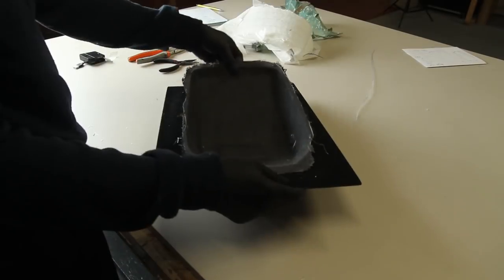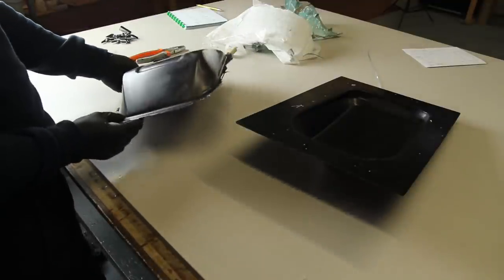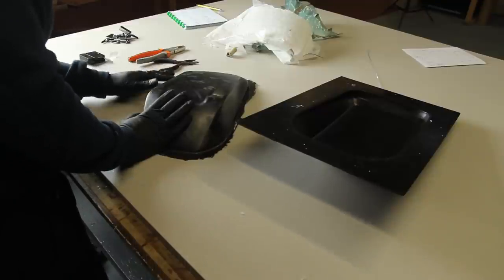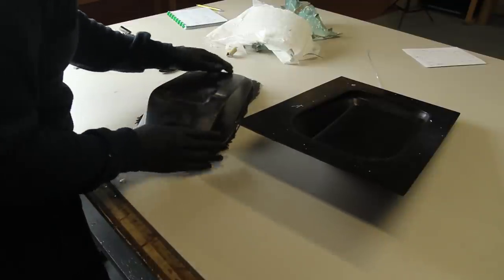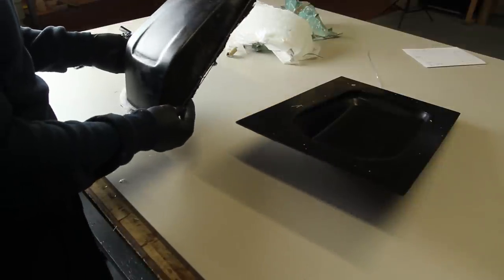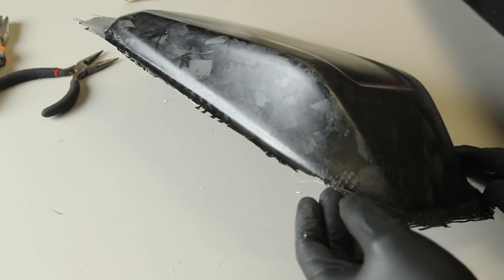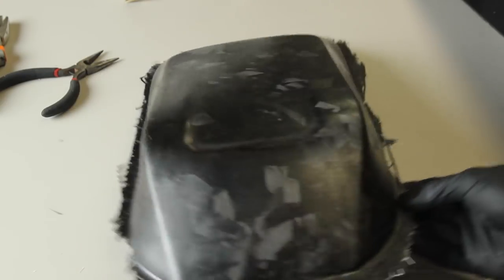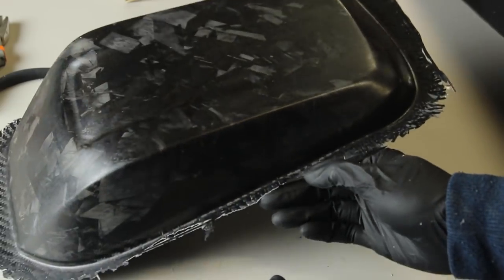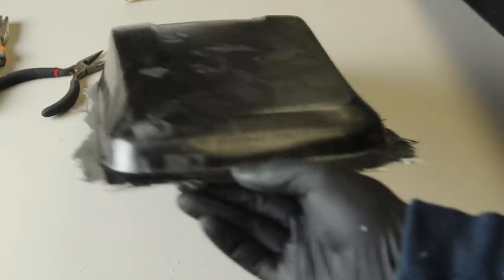As you can see in the results, we're getting a spot-on perfect finish. Except for the dullness of the mold, this is a pinhole-free part that I was able to clear-coat and send to a customer. These tests are more, as I said, to understand resin flow, because resin flow will be interesting to know for future testing and experiments using the RTM technique.